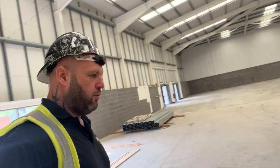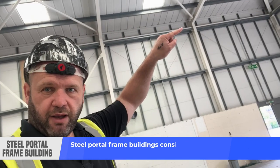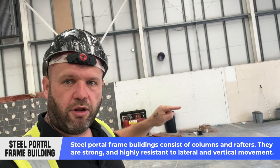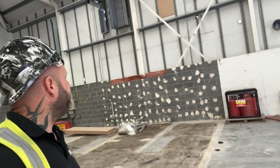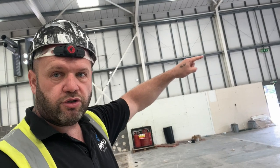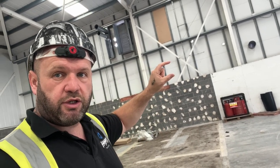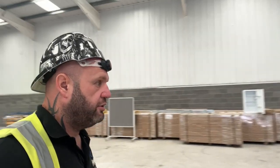One slight complication we've got: if we stand back and look, this is a steel portal framed building — these big steels that go across into the roof space, with a bit of block work and brick work. There is a brace here, an X-brace behind me, that still needs to be attached. The problem is this bay is going to be a roller shutter door, and this bay is going to be a roller shutter door — right where the brace is. So the brace needs to be moved, and as this part comes down it's going to fall down here, which gives us a problem.